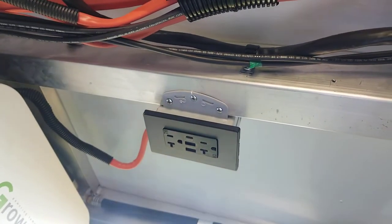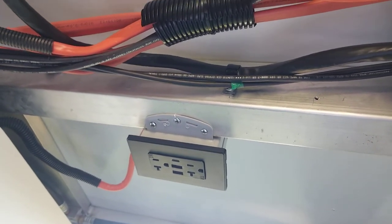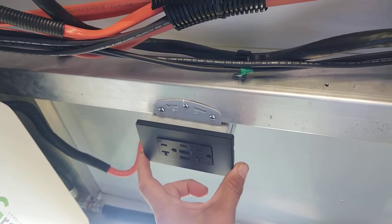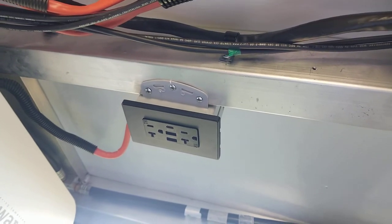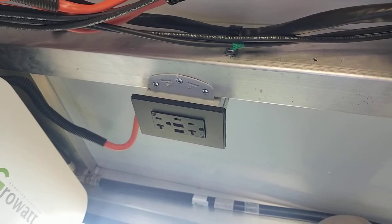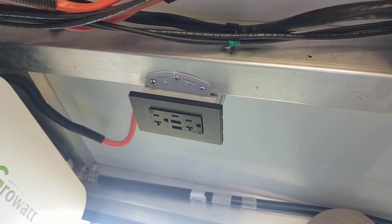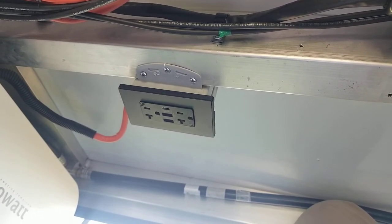And this outlet is going to be active whenever all the AC power is active. And I did not want to go through the effort of trying to tie it into the existing wire. I wanted to make an additional dedicated high power circuit. We could have gone with an actual RV 30 amp cord, like a female. And that's one of the options that we have, but I asked and that was not selected, so it just went with this right here. But this design is actually made for a 30 amp cord so that you can plug another camper into you. Because when you have the equivalent of 1800 amp hours of 12 volt power, you have more than enough to keep someone's mini fridge running without any impact on your own power.